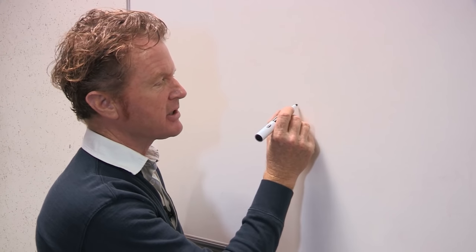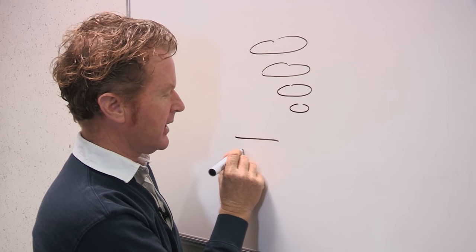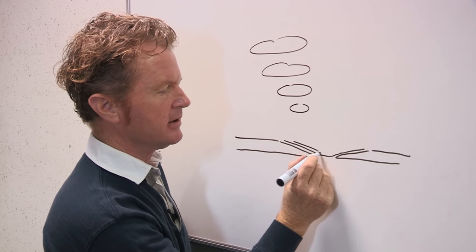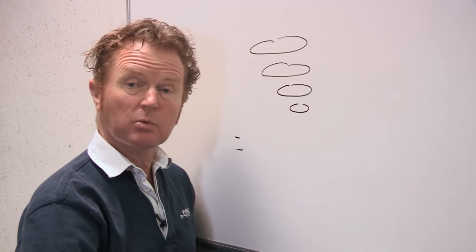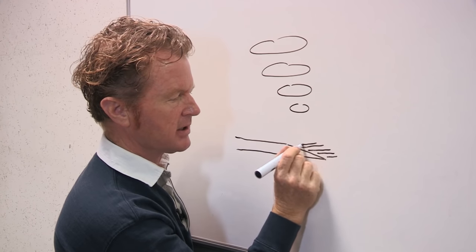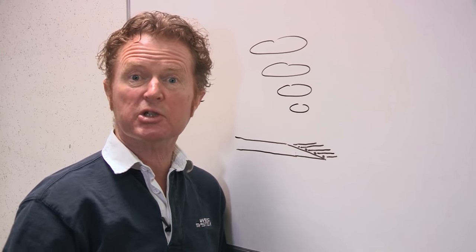You have a series of 4 different sized patches in total to build up to our laminate thickness. You might ask yourself which order do these go in? Well, they always go with the biggest patch first. The reason is because the biggest patch gives you the maximum contact surface. If you go with the smallest patch in first, you only ever get the edge of each individual patch contacting the surface. And what that does is create a series of air bubbles right at the interface of the bevel joint - and that does not produce a good repair.